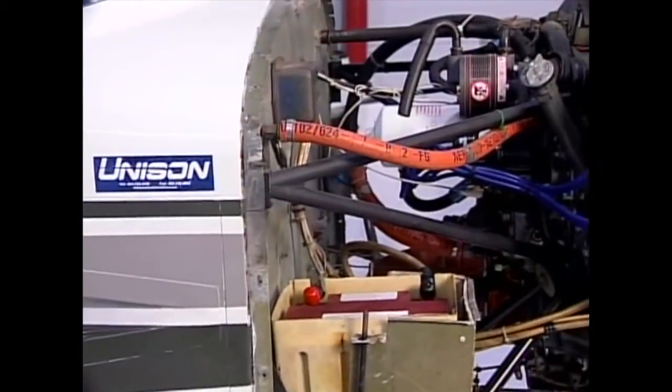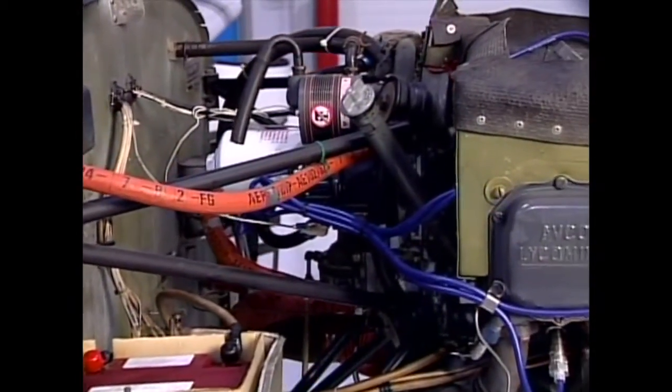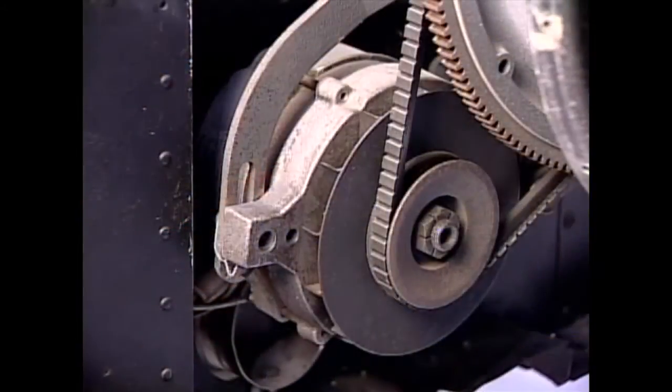Finally, the electrical system must be carefully examined. Starting at the battery box, the battery is checked and all wires and components are inspected. The alternator and starter are visually inspected, and the alternator belt is examined for signs of cracking and to make sure that the tension is correct. Then the inspection moves to the ignition system. The ignition system inspection begins at the spark plugs.